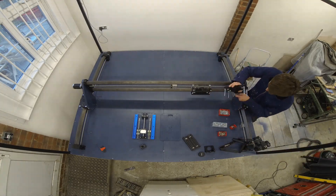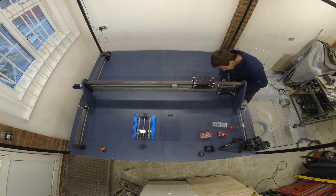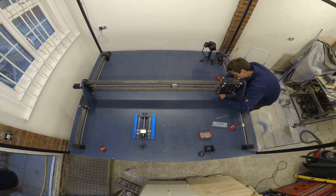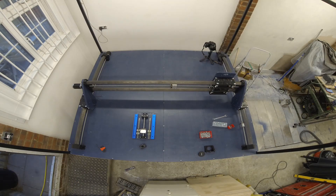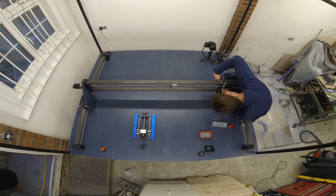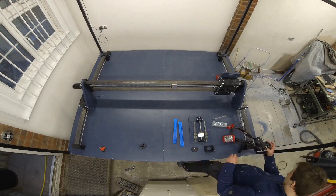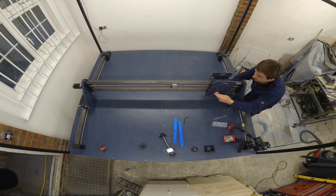Now you see me installing the x-axis carriage blocks — these are identical to the y-axis and just need bolting down and tightly securing. Off-camera, I pre-aligned the linear rails and the ball screw onto the plate and spent a bit of time making sure these were perpendicular to one another and ran true. This is done off the machine as it's easier to measure and calibrate, and can be offered up once the carriages are in place. It's worth adding four extra-long screws to the linear rails to stop the carriages falling off the rail when you offer it up — you don't want to lose all the ball bearings. These can be taken off later and replaced with the proper screws once the machine is all together.